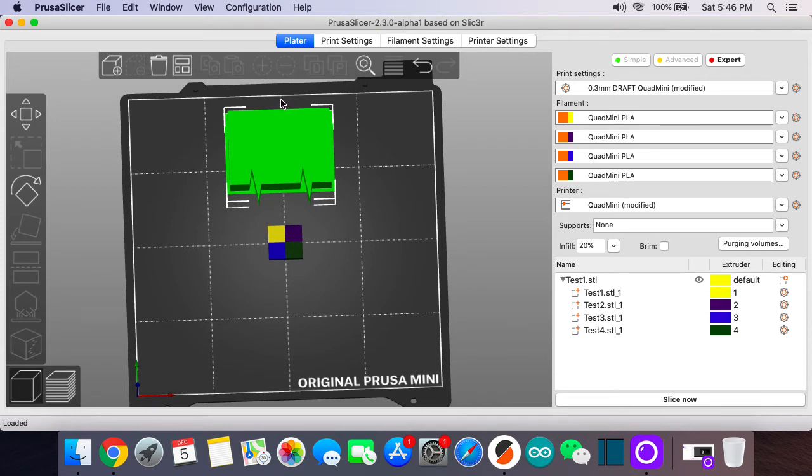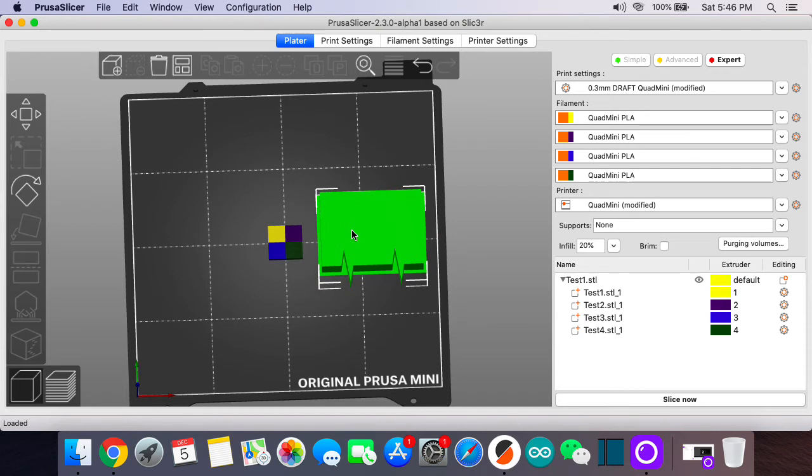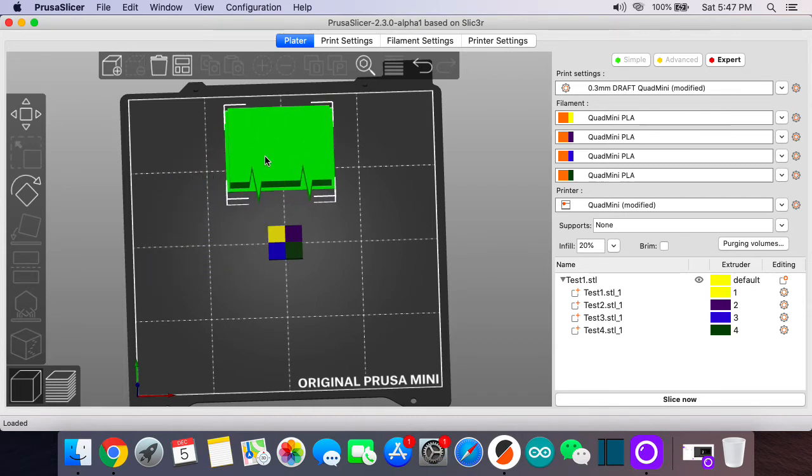So the nozzle is going to go right to this middle position behind the purge block and wait. It's going to do all its loading and unloading from that point. Notice that it's on the other side of the purge block. If, for example, I move the purge block over here for some reason or wherever, then I want to move that point onto this side. And the reason I'm doing that, like I said, is that I want this nozzle to rub across the top of this before it ever gets to our printed part. That way it cleans off any debris that might have dribbled out or was accidentally extruded between the tool color changes. So, but for now, we'll just put this right back there.